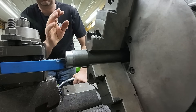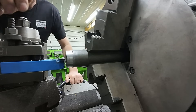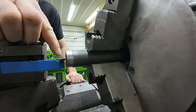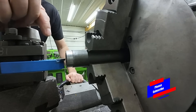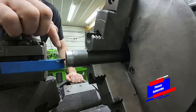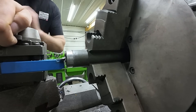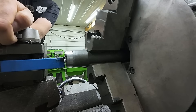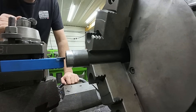I like these because they're cheap — you throw them away when they get bad, or you can regrind them with a diamond. But when you get on the internal chamfer, center is actually — you want to be a little bit higher because you're opposite of your external. So external, you want to be at or slightly below, and internal, if you come up slightly above center, it'll cut a little bit better.